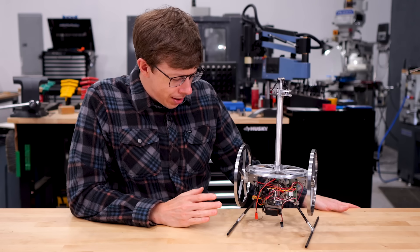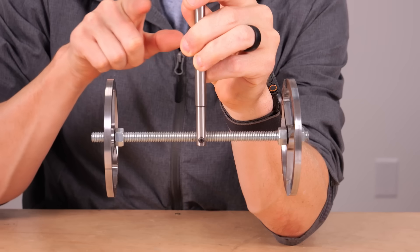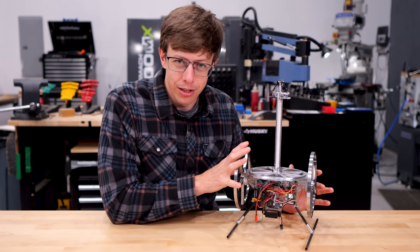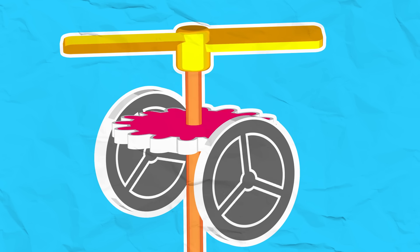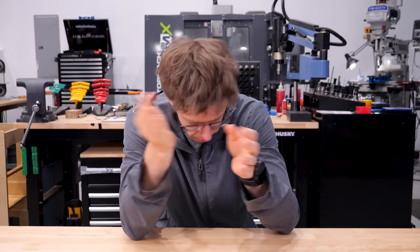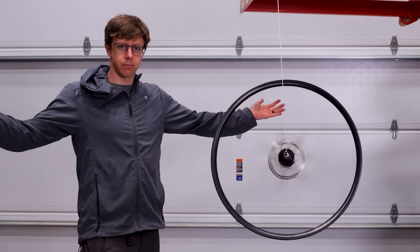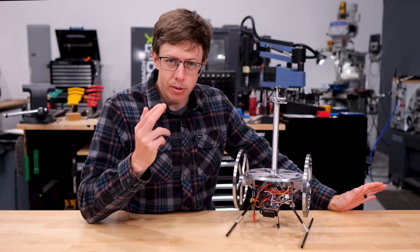I finished installing the electronics when it occurred to me that I'm an idiot. I was excited that the two flywheels cancel each other's precession — but do you know what else they cancel? Their gyroscopic effect. This design depends on it. The flywheels spinning the blades forward will create an equal and opposite reaction that spins the body of the helicopter backwards. If I try to fly it, the body will start spinning backwards at a thousand RPM, shed parts, and crash. I have no idea how I missed this — they demo this on the first day of physics class.